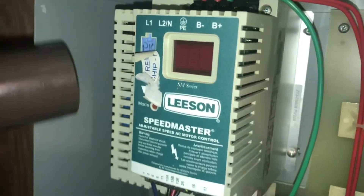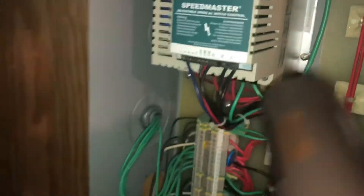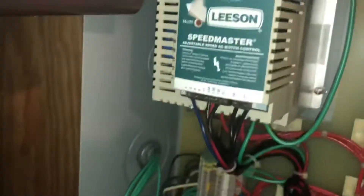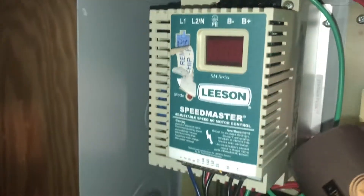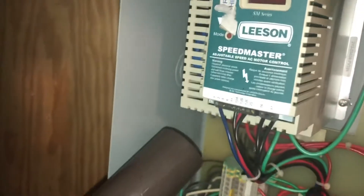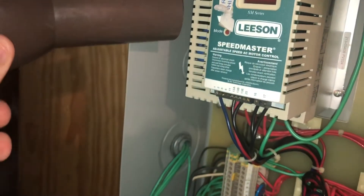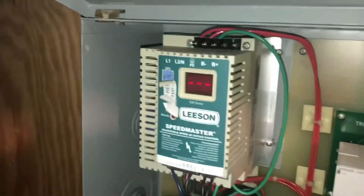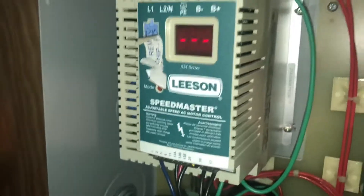All right, turning it on. Just watch where I use the hairdryer — make sure there's heat going. I'm going along the wiring, heating it up, heating everywhere around this thing. Depending on how long it's been cool, it may take 30 seconds to a minute. That's it — now that I've warmed it up it'll go through its reset process.